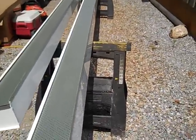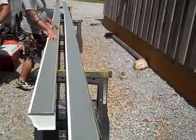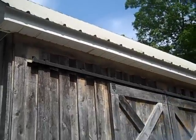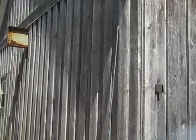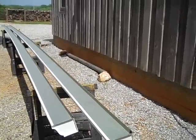That's one continuous piece — two 42-footers of seamless six-inch aluminum gutter. Looking forward to working with Charles and Jeremy on some future rain catchment systems. This is the prototype — I'm going to try to catch all the water. Should be about 700 gallons per inch of rainfall off of this roof. I'll show you the diverter and first flush system, capturing it to a tank.